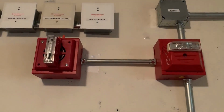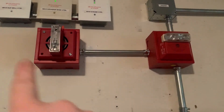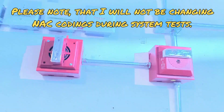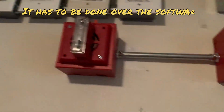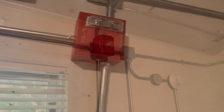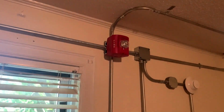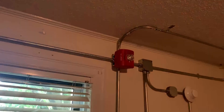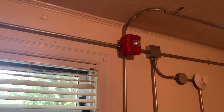That is quite loud, especially the NS. As you can see, both strobes are still flashing since I have the SHG on two-wire operation and the Wheelock NS on Wheelock Sync. And of course the strobe on the SPSR is still flashing because it's on the same strobe circuit with the SHG.